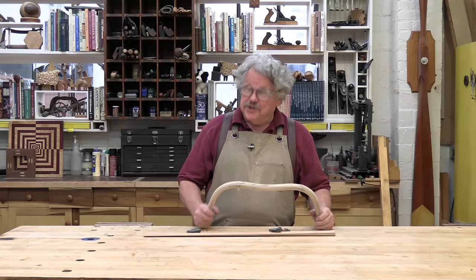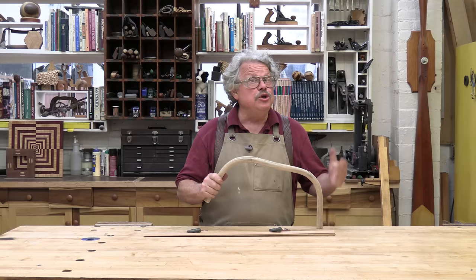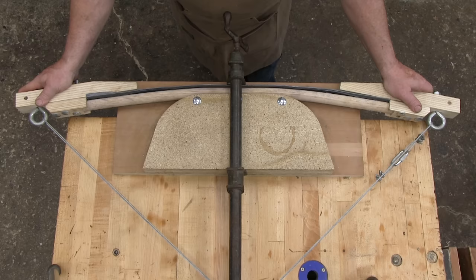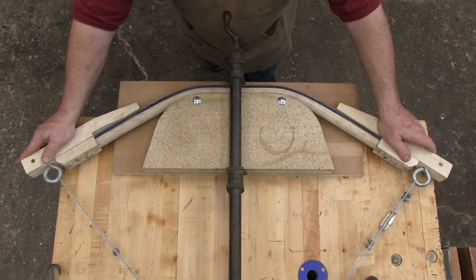To avoid stuff like this, you must compress the wood into the bend. If you watch our mustache handlebars video, I use a bending strap to accomplish this. The stops on the ends of the bending strap capture the wood and keep it from stretching. The fibers absolutely must compress as the wood bends around the form — there's nowhere else for them to go.